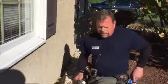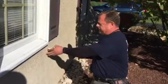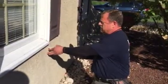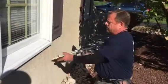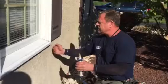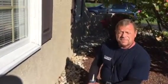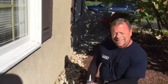We're going to blow those holes out one more time, and then we seal up the holes immediately with an ASTM C920 approved sealant. I want to make sure we get the sealant all the way in, nice and neat. If this is done properly, once the caulk dries, it's virtually invisible. This is Rob Lunney with Lunney Environmental — visit us on our website for more information. Thank you.